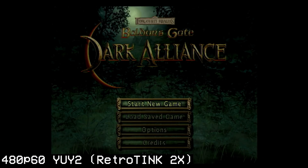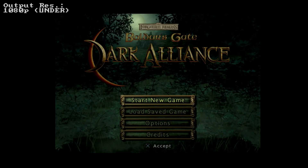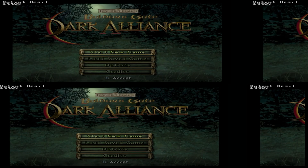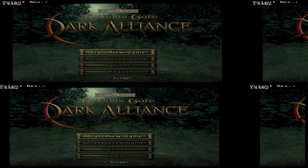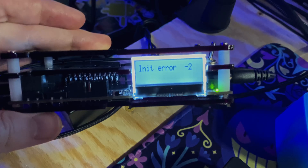The CU4K30 seems like a decent but not perfect solution for retro captures. 480p from the RetroTINK 2X works great, even in YUY2, as do 1080p and 1200p modes from the RetroTINK 5X. However, 1440p 6X from the RetroTINK 5X does not work, unfortunately. I can't currently test OSSC modes like I usually do, as mine appears to have just died — I've ordered a new one.